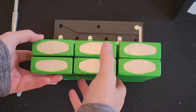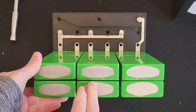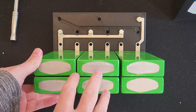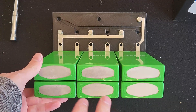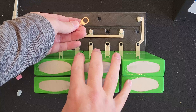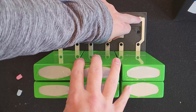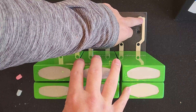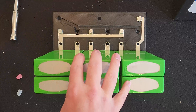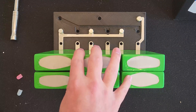We've got some work done putting the pack together. The 3D print has a recess for the bus bars on top — I'm using bolts to sink them in, secure them, and keep things aligned as I add cells so nothing shifts and creates a short. I've got one more row to do, but first I'm going to solder balance leads onto terminal rings. I'll use the ground and positive ends carefully so they don't create any shorts.